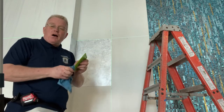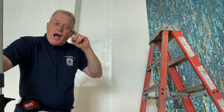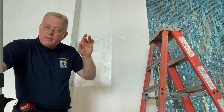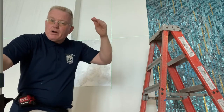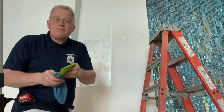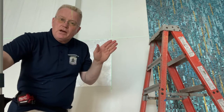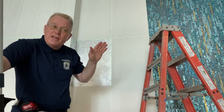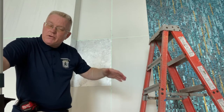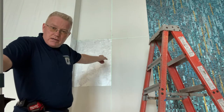If I were going around an entire room, I would leave myself 2 inches at least at the top, maybe 3, where I would bring the wall covering beyond 3 inches, a full tile cutting off 3 inches at the top, because as I go around with this product, I'm going to lose a quarter of an inch here after a corner. Yes, 3/16. You don't want to be off with this line. If something's going to ruin the product, let it be the carpenters who have already been paid and are gone. Because if it's you, you're gonna have to buy this product.